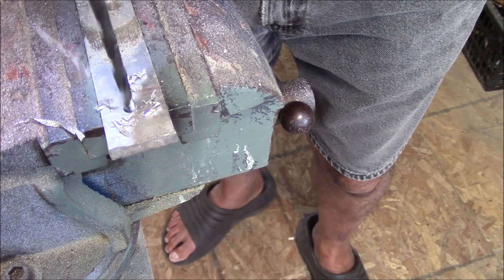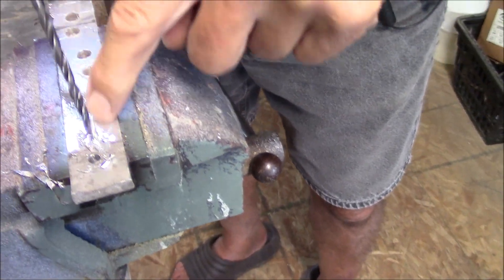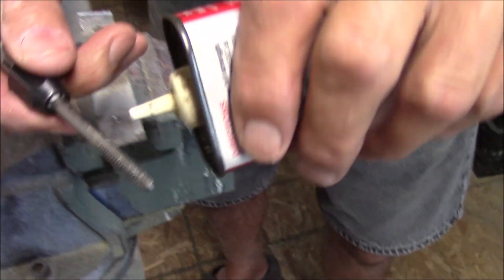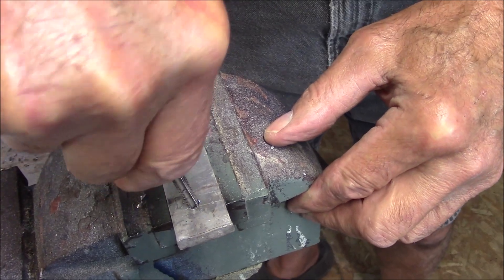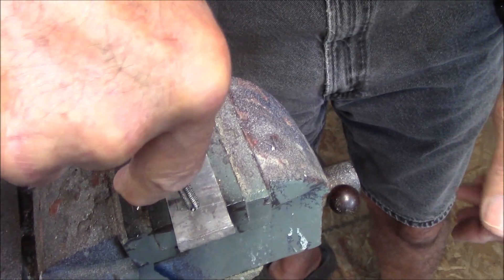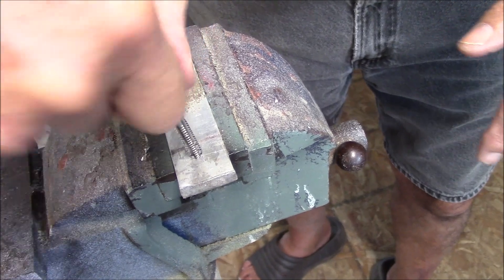Typically when I'm drilling, I find a slower speed is more optimum. You can see it's giving me nice clean large shavings — that's what makes for a good drill speed. Long shavings usually means you're at the right RPM. Too many people go too fast. As soon as the tap starts to grab, you can feel that it's not wandering around anymore — it's grabbing into the aluminum. That's a good time to go backwards and break that chip.